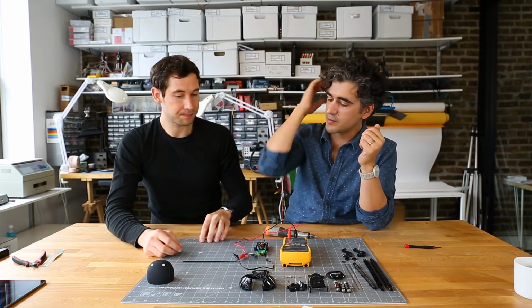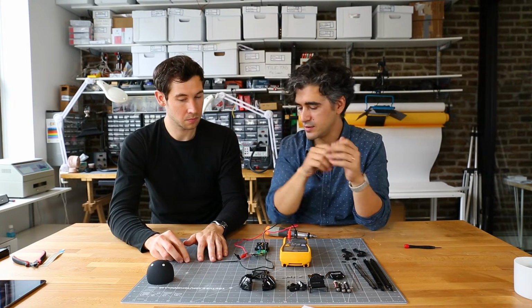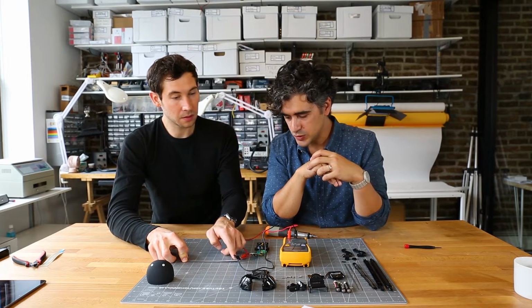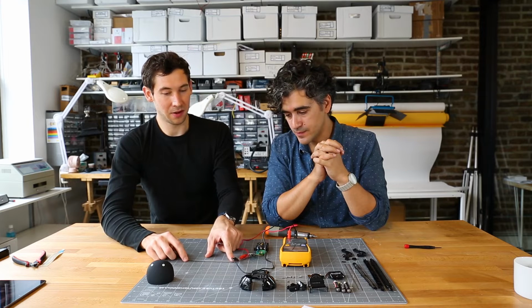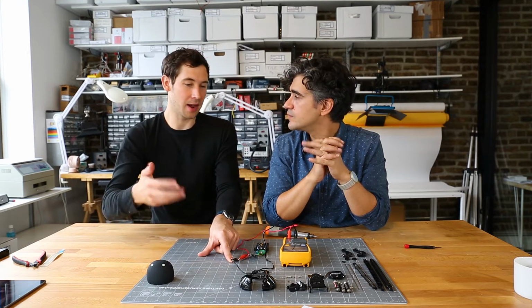Right. So that's probably why they have this here, so it creates a force layer. So as you push down on it, it's a more controlled interaction with the soft pot. Yeah, exactly. I think the other thing is, if you hold it, if you press it at the very bottom, any presses that are higher up in the chain are not sensed.